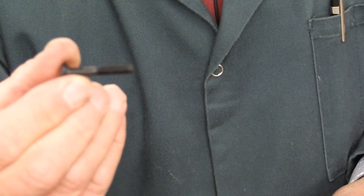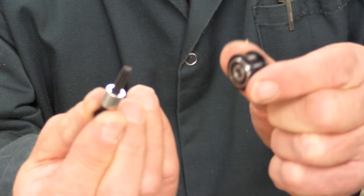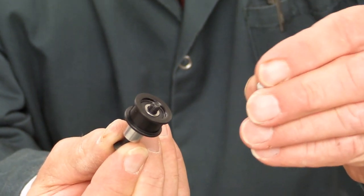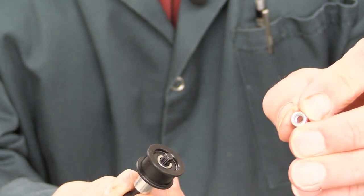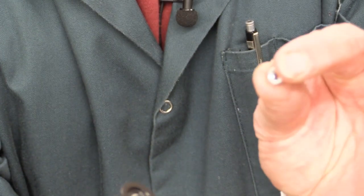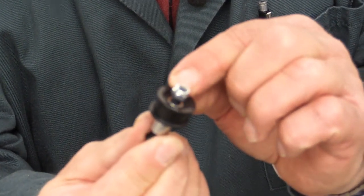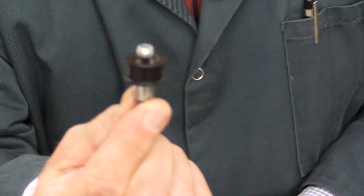With a countersink screw through the casting, on the inside goes the spacer first, then the bearing side of the idler wheel — that's the one with the most metal showing — and finally a nylock nut. If you've never come across nylock nuts before, there's a plastic insert inside at the top end that provides a locking function. To screw them on, start with the other end of the thread — the bit without the plastic — which is easy to start in the hole. When the bolt thread reaches the plastic part inside the nut, you can't continue with your fingers and must use a tool.